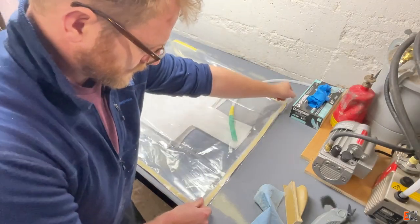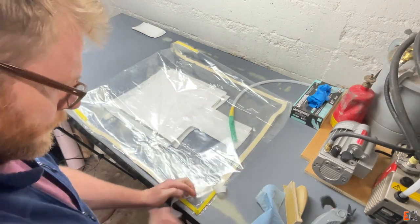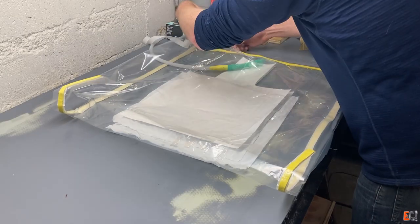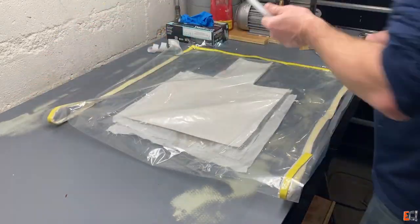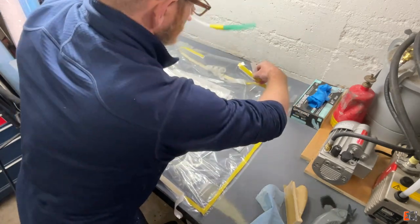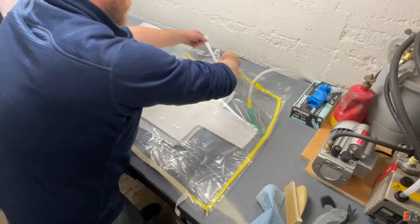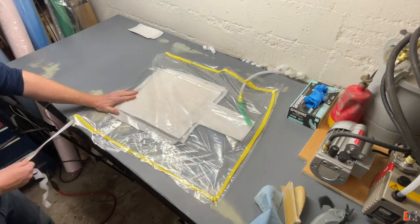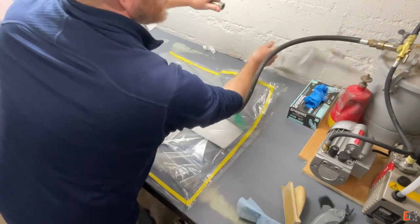To make this envelope bag, I put sealant tape around three sides, just a little past the fold, and flopped one half over onto the bottom piece. I considered putting the hose through the folded-over piece, but instead I added a little pleat so it lands on that extra tab sticking out from the side of the panel. Sealing this all up, the vacuum bag will compress it from both sides and evenly compact the laminate onto the surface.